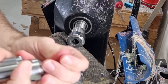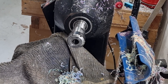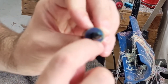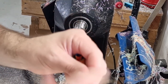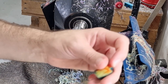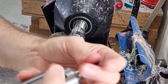If you're doing this with a softer resin it's easier; with acrylic this process is harder because acrylic is tougher to cut. Keep repeating — clean out, test fit, go again. You can hear it cutting. I'm using a cheap spare Bock nib for testing; never use an actual good nib for this because it can end up very tight and you'll inevitably get it stuck. This is the only reliable way I've been able to get this to work.